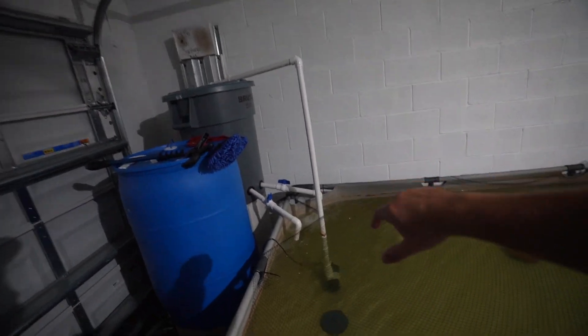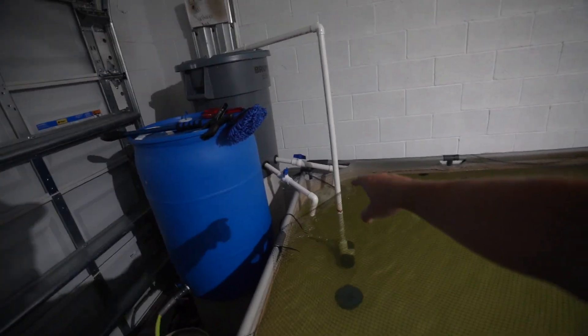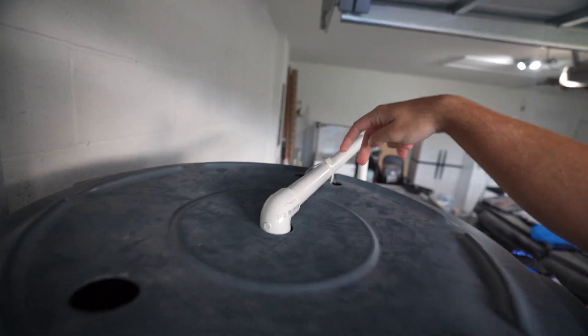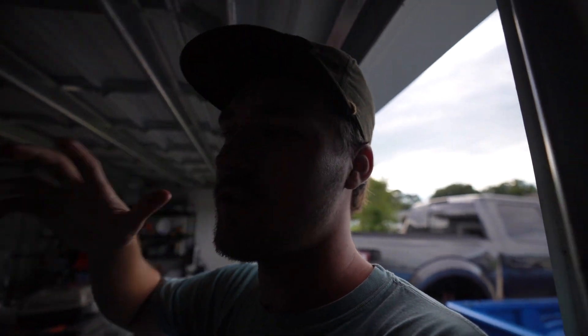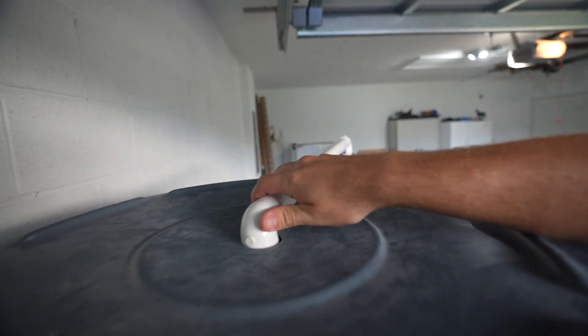We have two — actually, the far one is totally open all the way. Everything is one-inch pipe, by the way. Two one-inch uni seals come out of the can. The one on the backside pumps way more water than the front one. I wanted to use two pipes rather than one big pipe so I could have some pressure behind it, not just a full floodgate — I still wanted a little pressure and some flexibility in the flow.